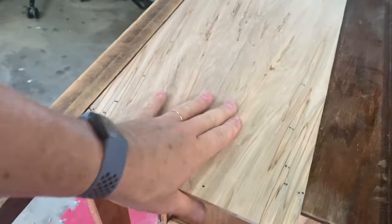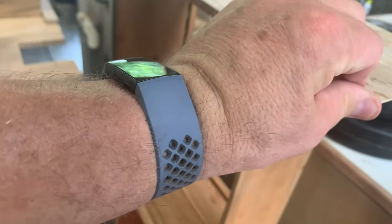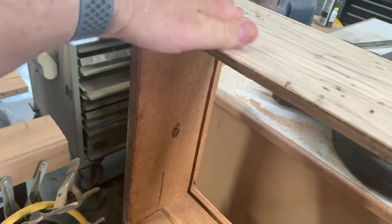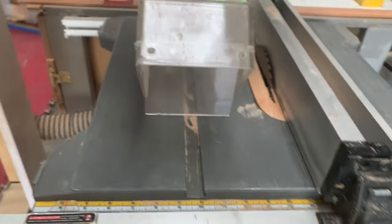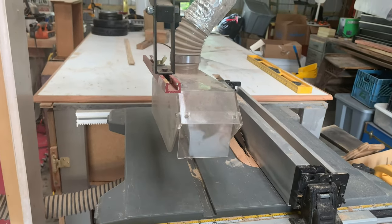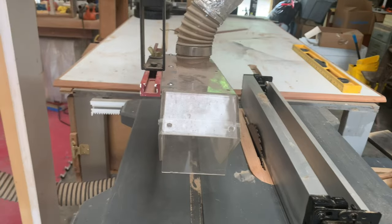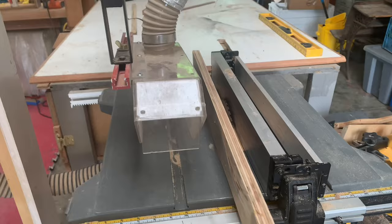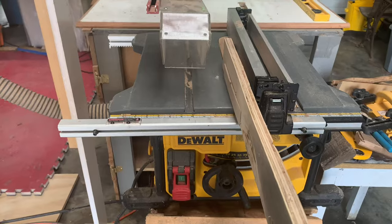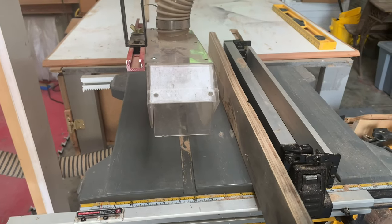On the wider ones I use them for structural integrity with these quarter-inch boards. For the drawers it's pretty thin — we don't necessarily need to add structural integrity to the drawers. Multiple passes, taking a little bit off each time, is safer to do. It's pretty tough cutting through this maple. It's wormy maple — a little bit softer, but still pretty hard on this little saw.